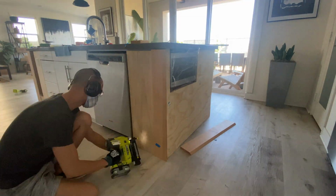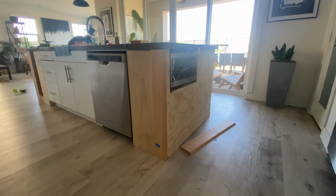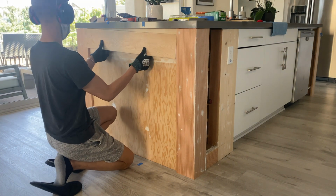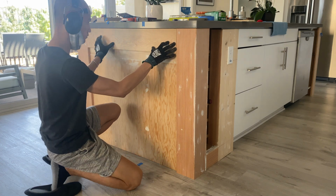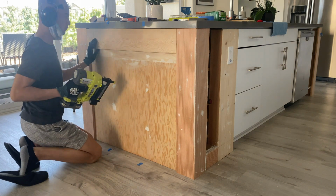I then put in my faux pillars for this side. I also covered up the old drawer and cabinet openings using 1/2-inch thick wood board. After completing everything, it still didn't give me that robust look that I was going for, so I changed up the design a little bit by adding a piece right underneath the island, connecting the two pillars to really tie in that sturdy look I wanted.